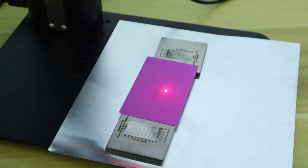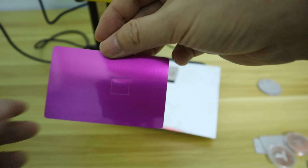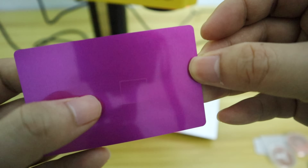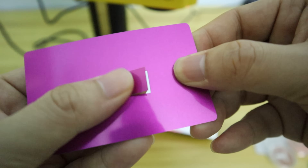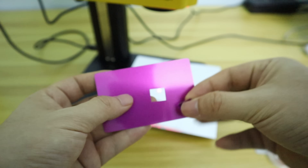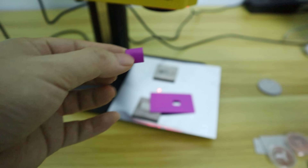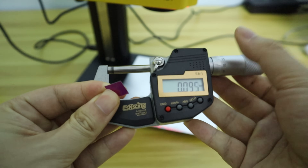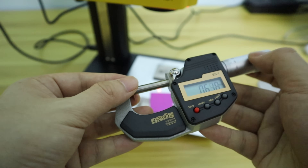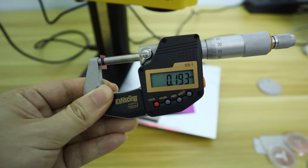The Handsmaker F1 Pro can cut a 0.2 mm aluminum sheet with one pass. Cutting metal or deep engraving metal is not its primary purpose, as it is mainly used for speedy laser marking. However, the Handsmaker F1 Pro 20W is capable of engraving metal to 3 mm deep according to the official specifications. But I have tried this with other 20W fiber laser engravers before — it would take about 5 to 8 hours of repeated engraving to achieve a 3 mm deep engraving of metals. I don't think it has practical value with such a long engraving time. If you want to engrave metals deeper and faster, then you need a more powerful fiber laser.